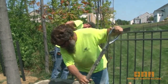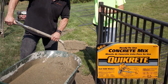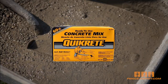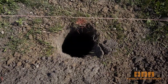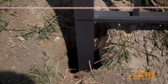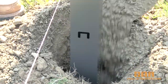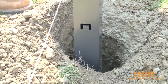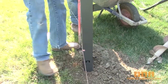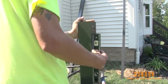Go ahead and mix your concrete in a wheelbarrow. We only use Quikrete brand that already has the sand and gravel included — all you need to do is add the water. You will need approximately 60 pounds per post hole depending on the size you dig and the size of the post ordered. Mix it on the dry side so your post will stand by itself as it dries. Next, shovel your mixed concrete around your post and fill to four inches below the ground level. Pack the excavated dirt tight around the post to help keep it from moving. Make sure the post is plumb against the string line and check for levelness.